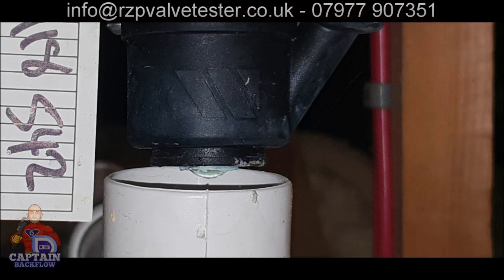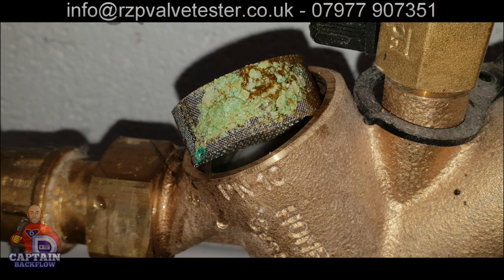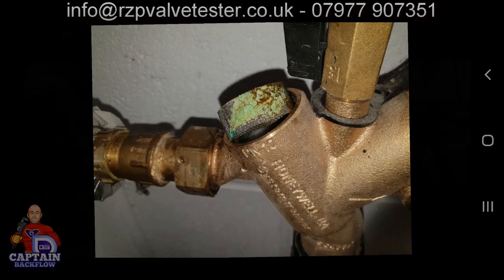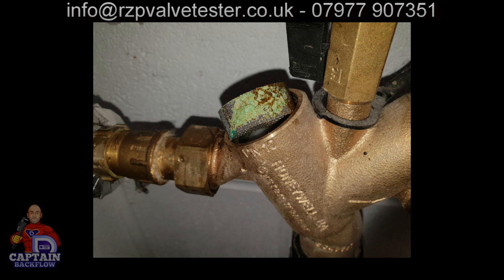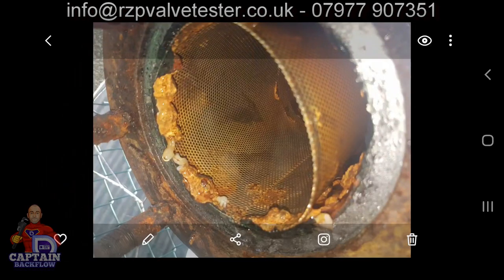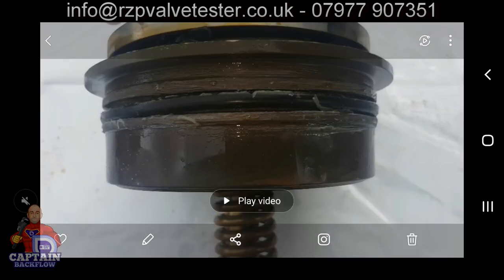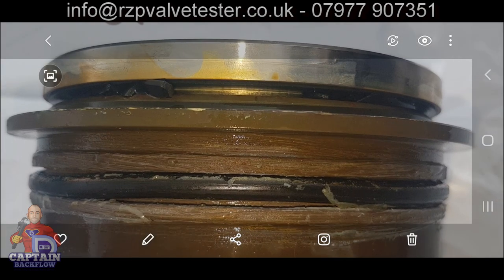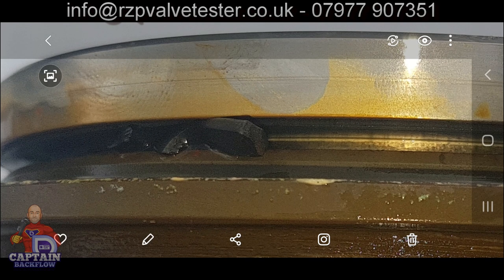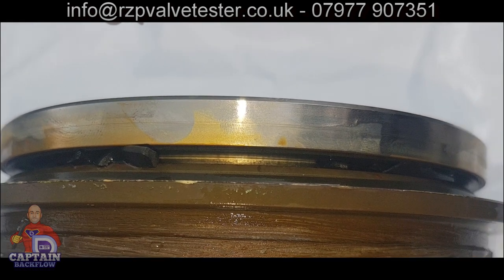This is a BA295 strainer where someone has used paste — I absolutely hate paste, there's no need for it. A plumbing contractor installed it and I had to commission the valve. When I checked the strainer it was just full of horrible stuff. Here's another strainer — on a four-inch RPZ valve. The strainer had failed and was allowing debris past. You can see bits of plastic that came up the four-inch main, sitting on the face of the rubber that closes and prevents backflow, with more debris wedged in there.